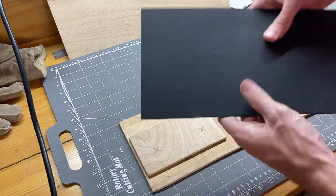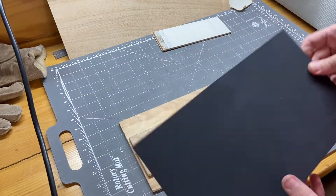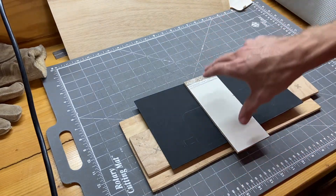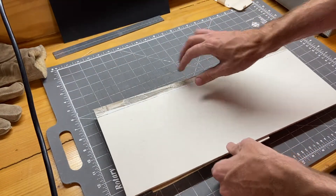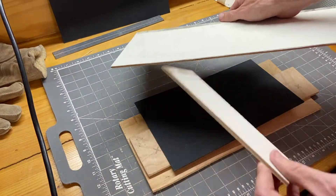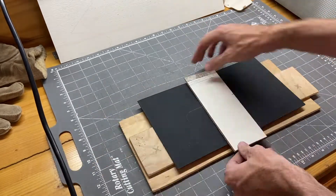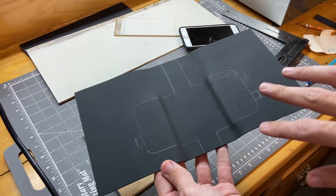After a bit of a reset — the first time I didn't have the other end of the mold — I'm heating it back up, placing it over the mold, and once the middle is soft and pliable I'll use one piece to force the center section down, then come over the top with another piece to keep the wings flat. These are just some eighth-inch to three-sixteenths wood paneling scraps. I also had to make the negative piece a little narrower to account for material thickness.